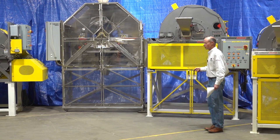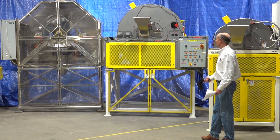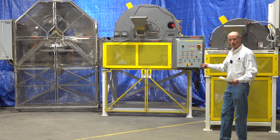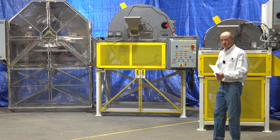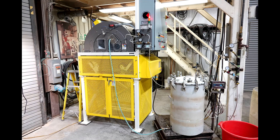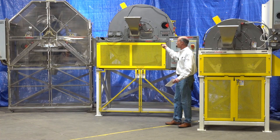We got into coating slow-release fertilizers and spraying liquids and hardeners that were difficult to spray, and the Mark 9s were born as a batch coater. We can mix in them and coat in them. It allows more forgiving internals for adding resins, hardeners, and all kinds of difficult-to-spray liquids. A lot of times we'll be heating liquids to a certain temperature so they'll spray at the right viscosity, like water. You've got a spray lance or spray port here — a long spray lance spraying liquid onto the rolling bed of product.